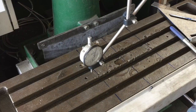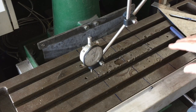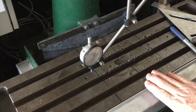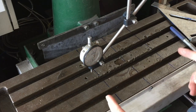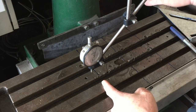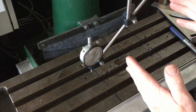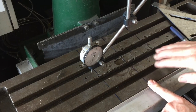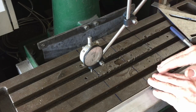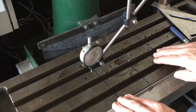I just realized the measurement window approach won't work the same way for the Y axis. For the X axis I can line up the center of the column - the table is right in the middle and the lines here represent the edge of where the column bolts to the base, so we're shimming based on that center line. That won't work for the Y because we'd be offset, so I think it'll be a bit of trial and error for the Y. I'll certainly stay within this range for the X axis.